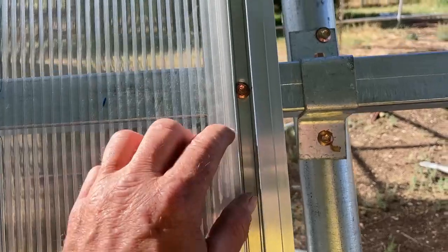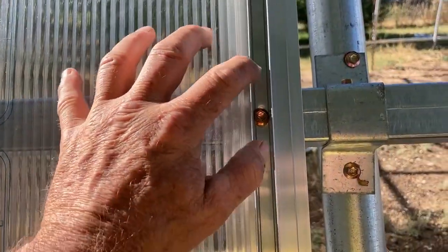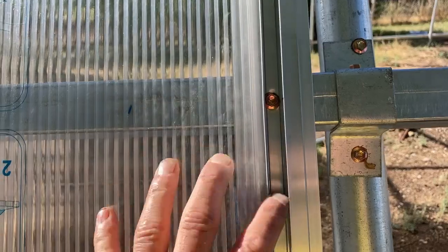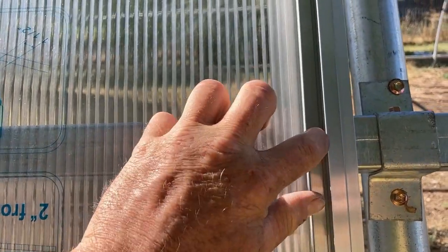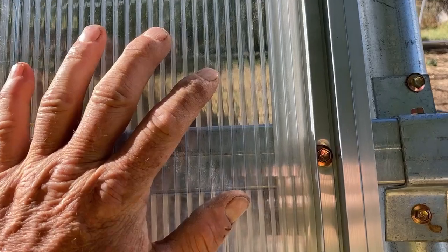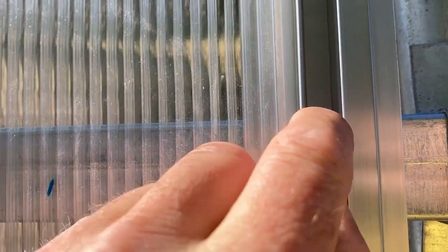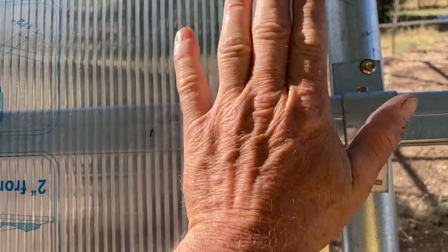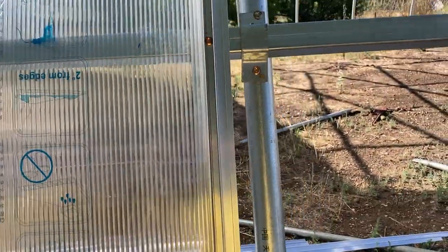The butt joint is placed after every panel is put into position. It's curved down to match the curvature of your greenhouse and it bends just fine, but you need to put a screw through it into the purlin. If you're not careful, you can put it off to the side too much and it'll interfere with the male cover plate you put on top. Do your best to get that right in the middle when mounting your trim.